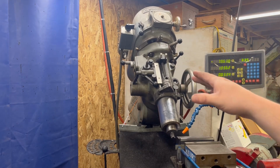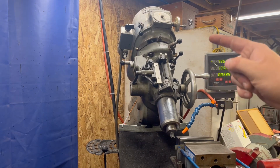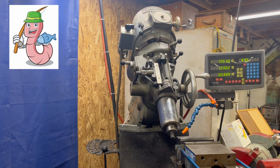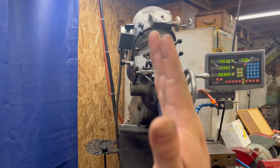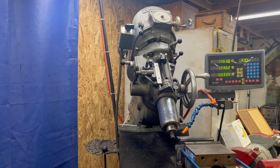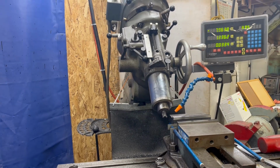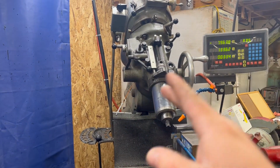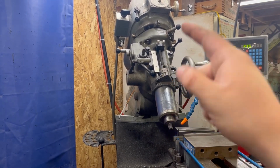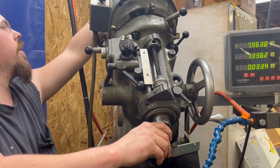The reason the head of this machine stays at a 45 is because the worm gear is worn out. So you could tilt this head up and down straight. You could tilt it 45 left or right and still get this same pattern, you know, 30 degrees. But with that worm gear worn out, I have to tilt this head by resting the head on my shoulders and spinning the worn out worm gear. And that's about a 300-pound head.